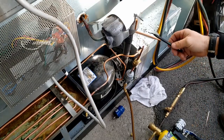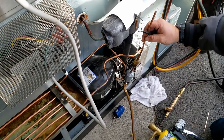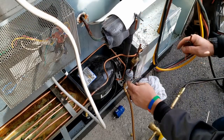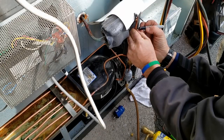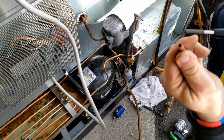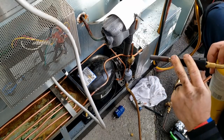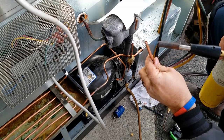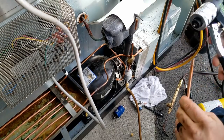What I did is I deburred that and then blew nitrogen through it to get any specks of crap out. My idea here is to make it so my pockets are on the bottom so everything falls down when I'm brazing it into place. I basically cut one extra spot I didn't need to, so I made a mistake there. The only reason this torch would make the copper carbon up is if you get it so hot that it causes plating. With a hand torch, if you don't take it glowing red, it's not going to plate. All I'm doing is warming up the copper so it expands a little easier.